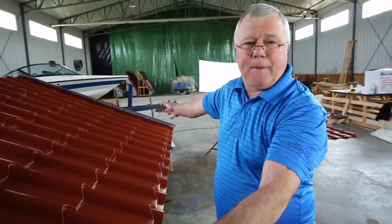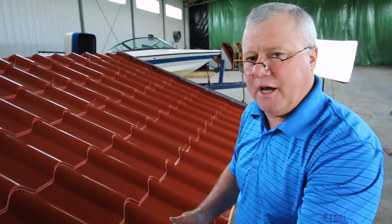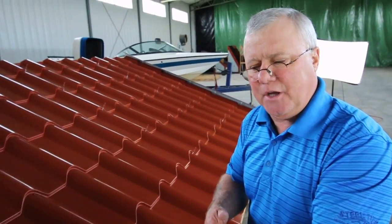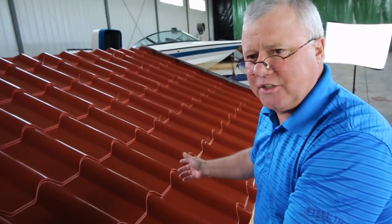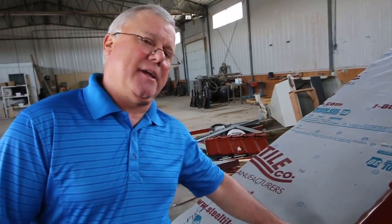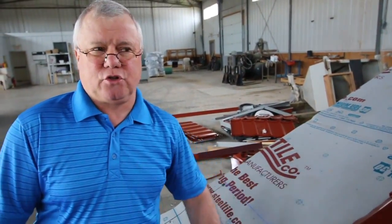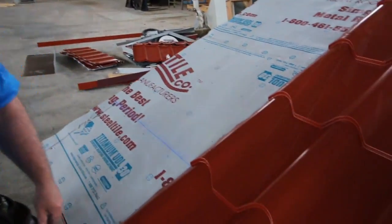After you have four panels on and you're staying on the line, that doesn't mean you're clean the rest of the way. Put another four panels on, move them up or down to stay on the line, then put screws in to hold them before continuing with the next four. If you seem to be hitting the line consistently, you can put more screws in as you go. If you're coming above the line and losing your overhang, push your panels down from the top, get your mark back on the line, put a few screws in, and you're good to go.